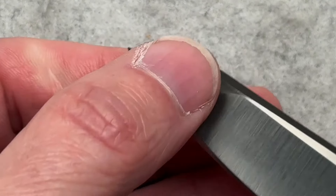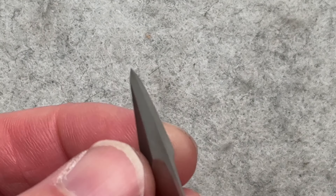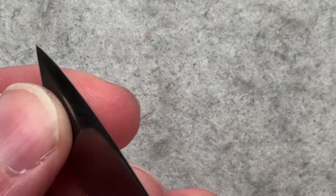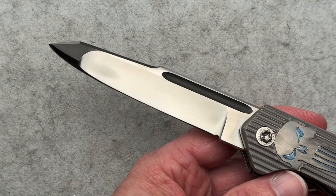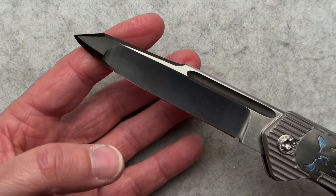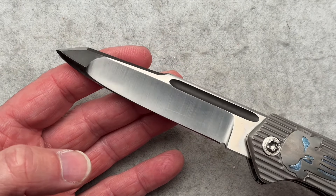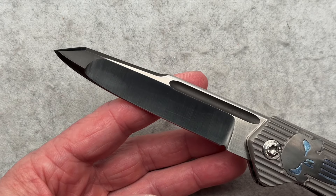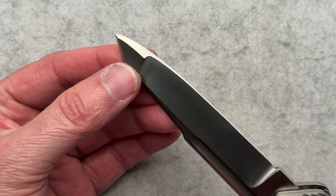There's a very nice flat grind here — almost no grind, really — a flat grind that goes down to zero, and then a nice hollow grind on the main part. That gives you 3.6 inches of cutting edge. I'm still getting used to this new camera that zooms in times five instead of times three. Behind the edge on the main part is 0.015 — I didn't even measure the behemoth up at the tip because that's just obnoxious.